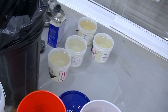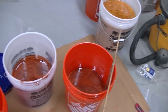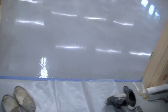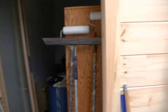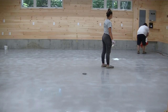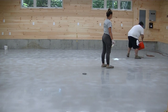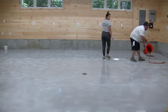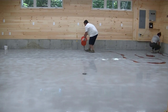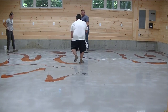While we're doing that, we're getting our metallic epoxy all measured out, getting our mixing station set up, getting everything separated — our three-gallon kits. We're going to mix three gallons at a time. We've got two different colors we're putting down: an orange gold and a brass color. The brass color is going to be about 60 to 70 percent of the color, and the orange gold will be the other 30 to 40 percent. We just ribbon this all out all over the place, kind of random, no set patterns to it.